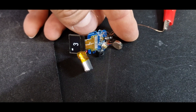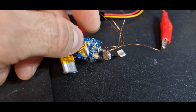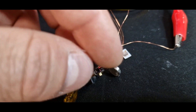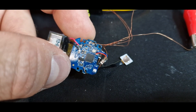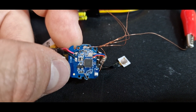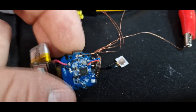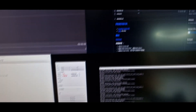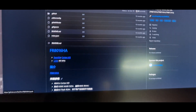You can see a bit of the PCB here. They have some nicely labeled UART pins, like an RXD and a TXD on the backside. Googling for the chip, which is the so-called FR8016HA, there was a nice place to find the SDK for it, which is pretty nice to find.